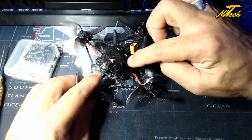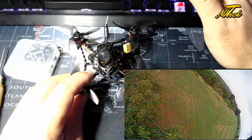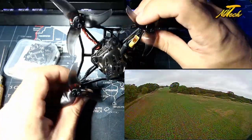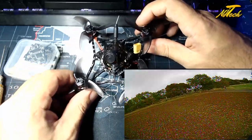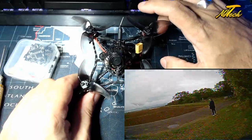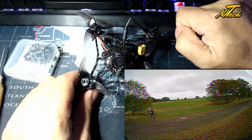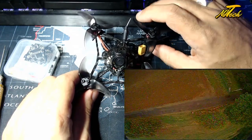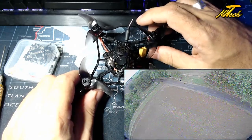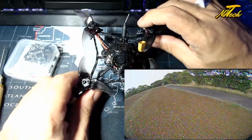The Diamond VTX has an onboard DVR — that's a really nice touch. Gives you 1280 by 720 resolution at around 25 to 30 FPS. It's a nice picture, and I think it's worth the extra gram having that on there just to get a nice clean video of your flights. The only thing I will say is it does occasionally drop frames, and I know people have been reporting that. It's not end of the world — it happens every so often, but just once in a while you'll notice the odd dropped frame. There are some clips you might need to snip out or do a hard cut on. It's nothing that upset me too much, but just be aware those things have been reported and I have experienced them.